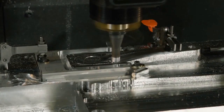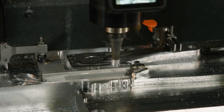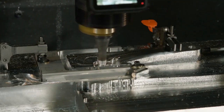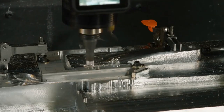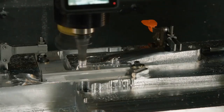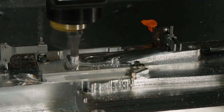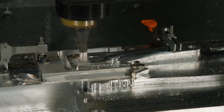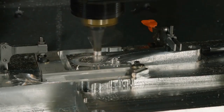Now this is the friction stir welding process. Here we have our spider and crank arm assembly put together — you can see the weld line, or the joint interface line, that this machine is going to follow. The tool is spinning at around 2,000 RPM, and we make enough heat to soften the material but not melt it, and we join it together. You can see a little wobbling here — that tool has a very long stick-out to clear some of the clamping mechanisms, but typically we want it as short as possible to minimize that walking or wobbling.